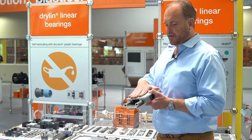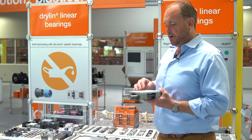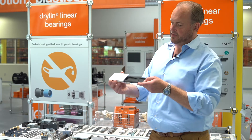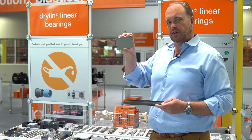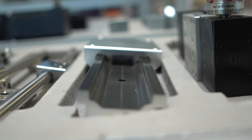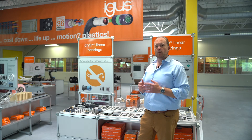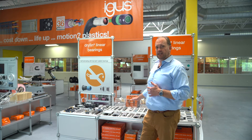This series is available with carriage assemblies with a standard plate, again in various widths. We also have a mono carriage version which eliminates a lot of the components and basically has our lubrication-free plastic bearing liners clipped into a single piece mono guide carriage. The guide rails are all based on aluminum extrusion profiles for low cost. We also offer a clear version and a hard anodized version. You can get them with and without holes, and we also offer the 316 stainless models.